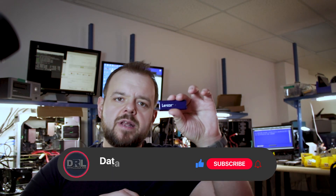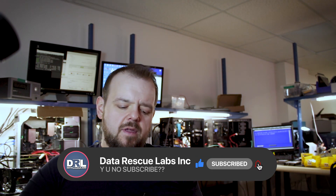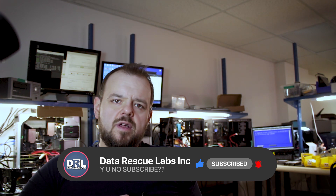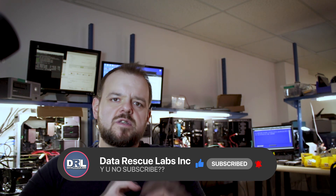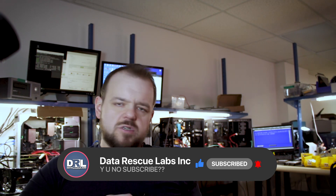Hey, I'm glad you're here for another video. Today's case is gonna be this 8 gigabyte Lexar drive. The case is very interesting because this is a will dispute — the family found this USB drive and they think there's a will on here, but the drive is not working. It's a very simple job, simple controller, so we're just gonna pull the chip off and put it through V&R and see if we can recover it. Maybe we'll use Flash Extractor — we'll see. Let's get to it and see how we can recover data from this failed USB drive.